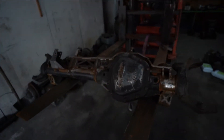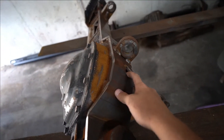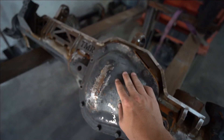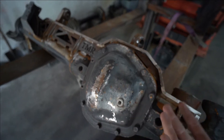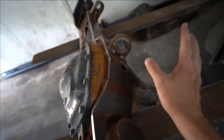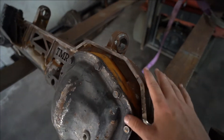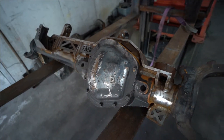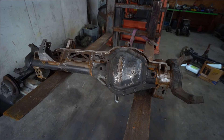In this next part of the video, what we did is we took a plasma cutter and cut a hole into the top of the axle truss. The reason for that is because I wanted to use the factory breather location which comes right out of the top of the axle. TMR has an accordion little breather that gets tapped into the diff cover, but personally I just didn't want to do that, so that's why we went ahead and cut a hole in here to use the factory breather location. That's not going to affect anything structurally just because of how thick and sturdy this swap truss is.